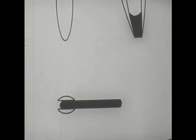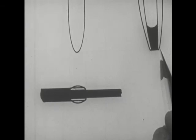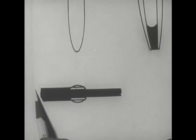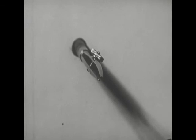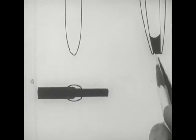If bright spots can be seen when the pen is viewed from the end, the nibs are thick, and the width of the line will vary from the distance between the nibs to the distance outside the nibs. The bright spots on the end of the pen may be due to wear from use. Here also, the width of the line will vary from the distance between the nibs to the distance outside the nibs.